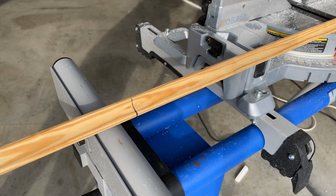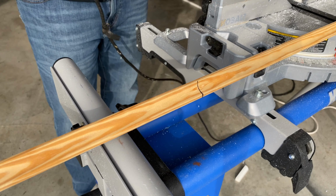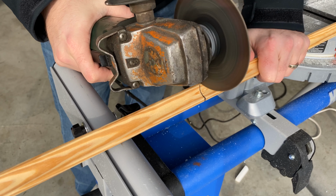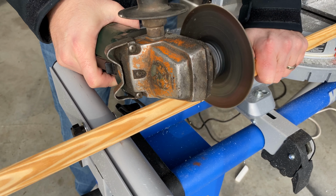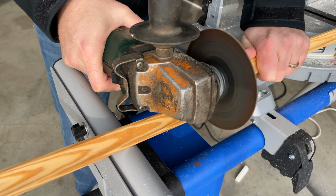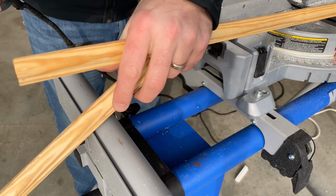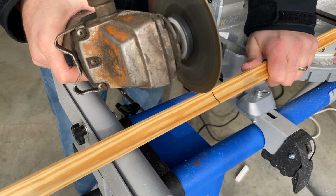Whipping out the wood trim, I'll go ahead and talk about the measurements that I use on the 39-inch wide PAX display case. For the strip that will mount to the top of the case, I use a 37¾-inch wide strip. For all the shelves below, I use a 36-inch wide piece. The reason the wood strips used for the shelves are shorter is that when you attach the reinforcement bar to the shelf, you have to install the wood strip a little bit further back, and then it aligns right with where the shelf pins are, so you need that space for those.